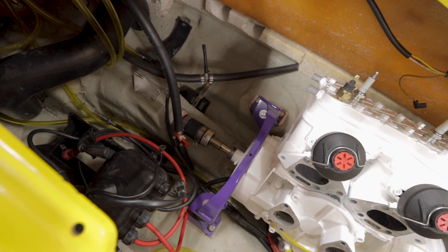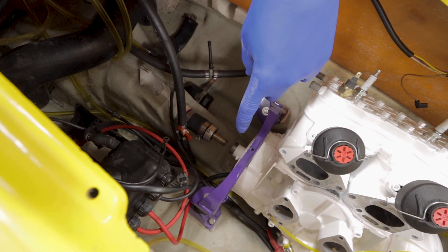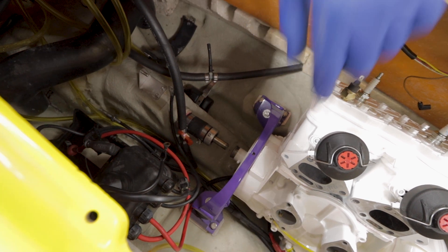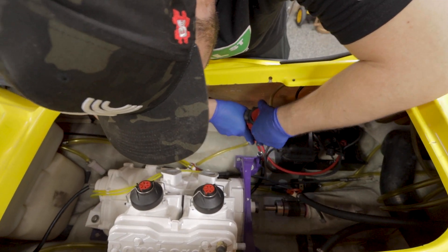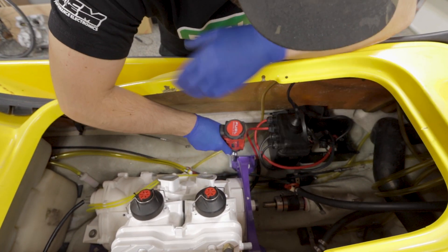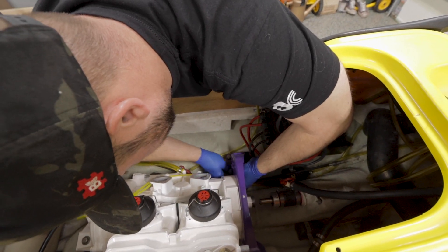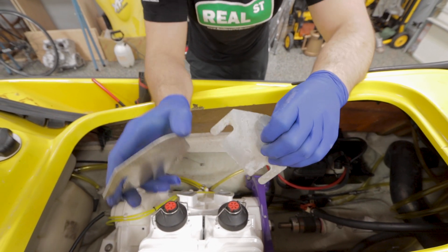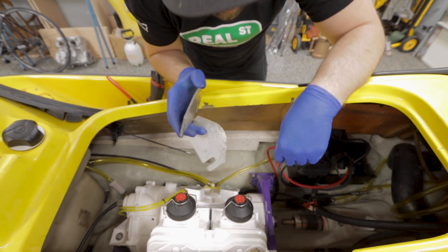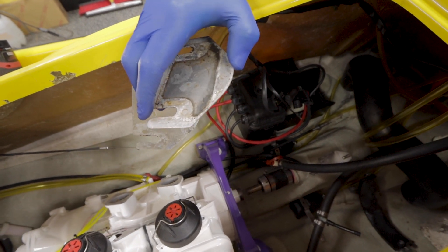Because this is pretty close, I'd say the front mount and this side mount are okay. This one just needs to come down — I'll loosen up that mount and take some of these shim plates out. Once I see what shim plates are there, I'll be able to tell if I need to add a couple thin ones or deduct one. So there are two plates on here — one thick and one thin. With no shims — you know what, it goes pretty good in there. It's hitting the top a little bit; you can hear it just hit the top.